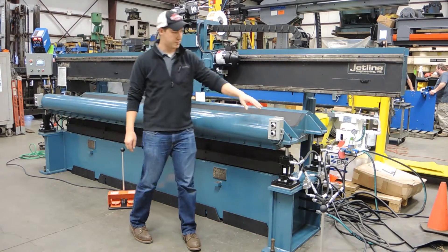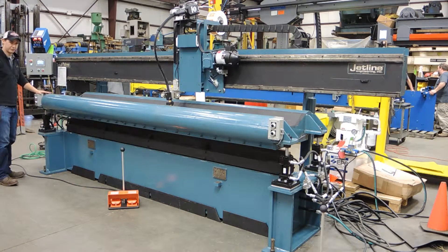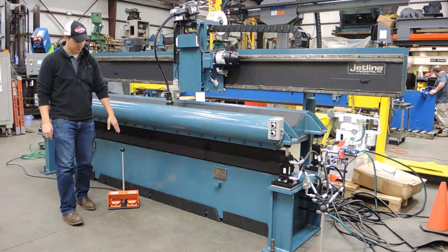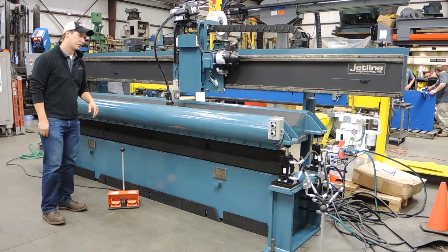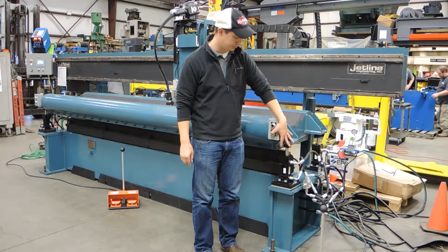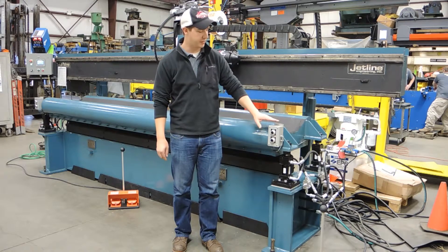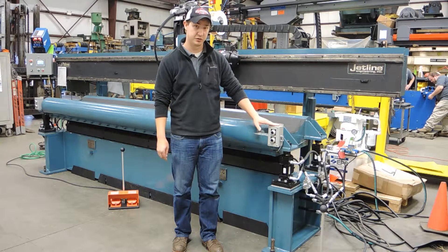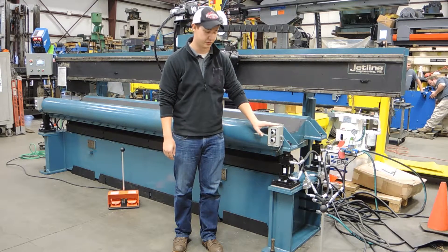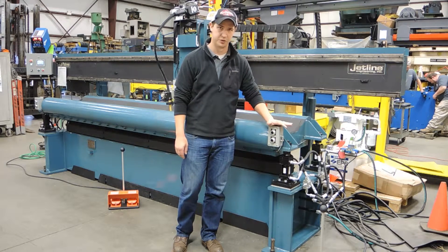We have hydraulic boxes and controls on this end as well as on this end. We've duplicated the controls for the airbags for clamping the fingers here as well as down here. To lower the bed into position to start your weld sequence after you've loaded your parts, you press the lower button. At the end, we've got the option so that the unit will automatically lift the torch, release the fingers, as well as lift the bed to speed the process of loading and unloading. You also have the ability to manually raise the bed from this box if you have some pick-up issues while loading your parts.